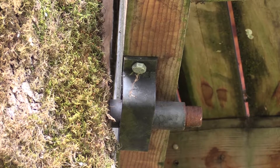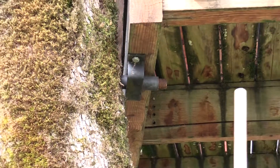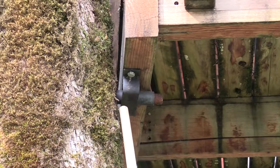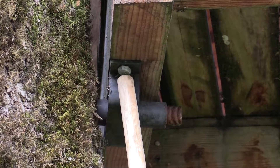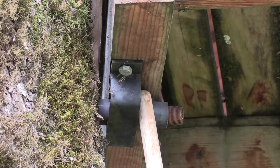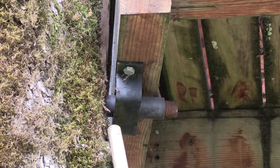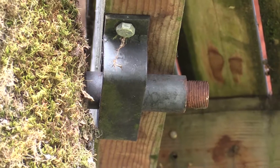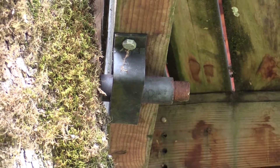For placement of your brackets, you want to place your bracket so that it bears on the inside of your beam. You would think that you'd want to put your bracket right in the center, but if you put it in the center or to this side, you move your load out. The GL works as a lever arm, so you want your load to bear to the inside.